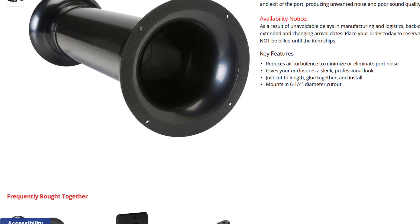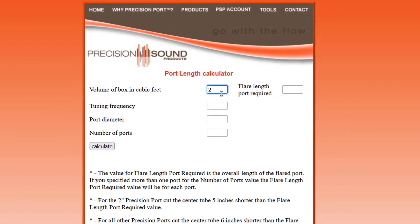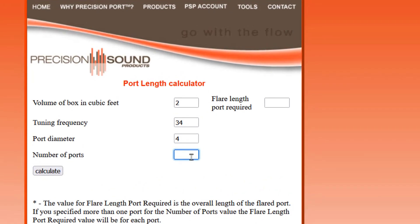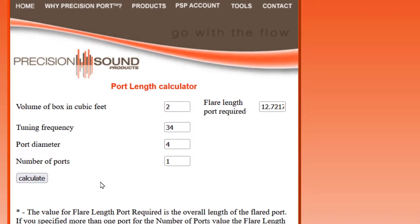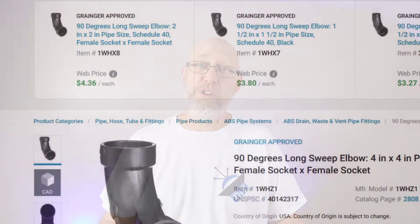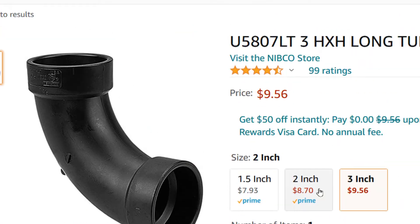That's one reason why I like these precision ports. After you figure out your desired enclosure size and tuning frequency, you can just go to the precision port website and they tell you the overall length of your port. The standard kit has a one foot centerpiece plus two flares for an overall length of 18 inches. Unfortunately, they don't sell elbows, so if you need a bend inside of your enclosure, you'll have to adapt the precision port to a PVC or ABS plastic, which is a little bit of a problem because the wall on these ports is just a tad thinner than the wall for PVC pipe, so you've got to construct some kind of coupling to make it work.